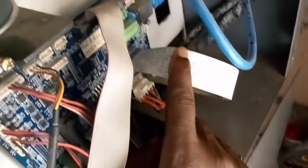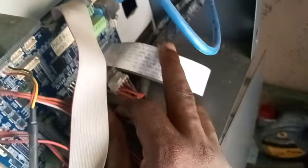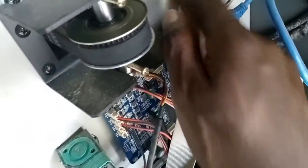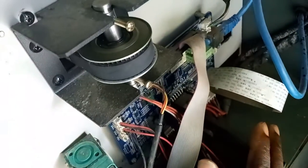When this cable is not connected on either side, or the cable is damaged, that is when this board will not communicate with that other board. If the cable is fine and you still get error link fail, then one of these two boards is bad — it's either this board or that board.